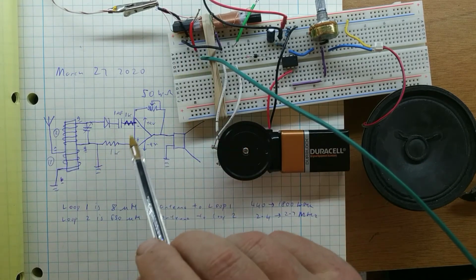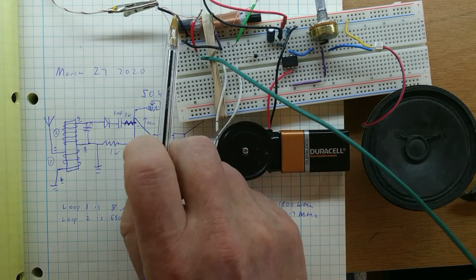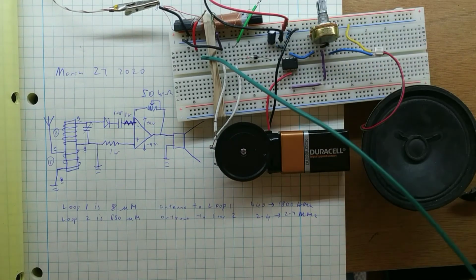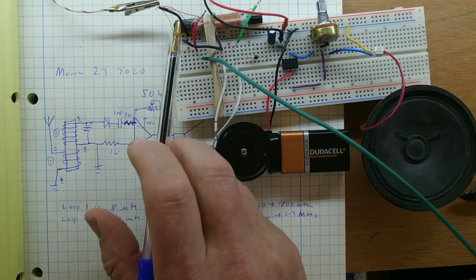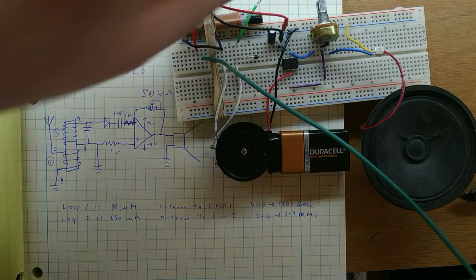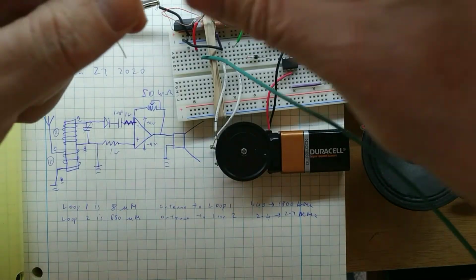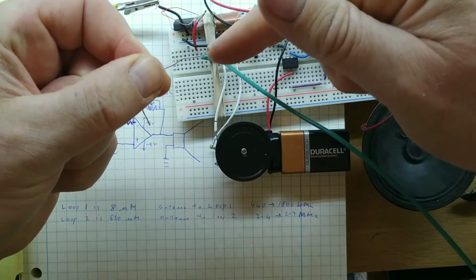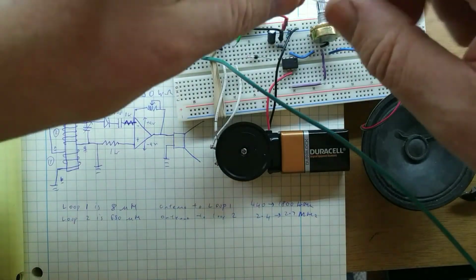Oh yeah, there is something I should tell you. These wires, it's called Litz wire. It's 3 copper strands. Hold on, I'll turn it down. It's annoying. It's 3 copper strands, and I put photographs of it in the write-up, and it's wrapped in a kind of a nylon. And if you have to ever unwrap it for whatever reason, then what you got to do is this. You just take it and roll it with your fingers like that, and you'll be able to see that the wrapping comes off if you roll it in the appropriate direction. You might have to test a few times to see which the direction is.